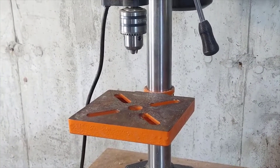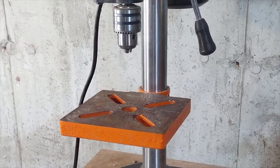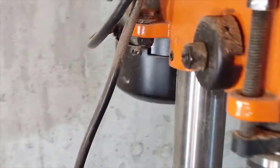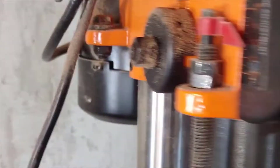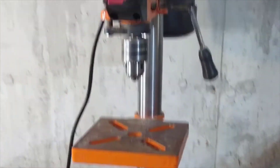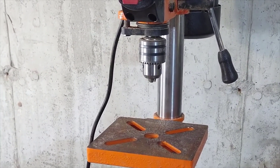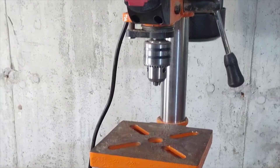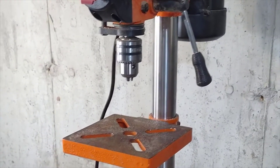Pros: very sturdy. I've had to do very minimal work to maintain this thing — really just keep it dusted off. I did have one failure of a part. If you see inside this here, there's the spindle return spring. When you crank this down, this spring pulls the spindle back up without you doing it manually. That broke on me — pretty obviously a defect because it happened after about a year. I called or emailed WEN, and they replaced the part for free — just sent it right out. It's lasted ever since, and I'm sure if it broke again they'd probably replace it again.